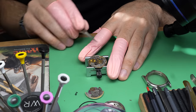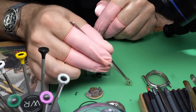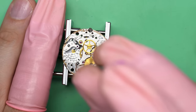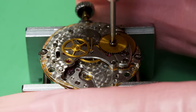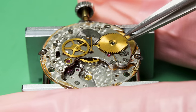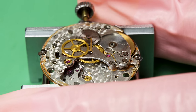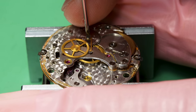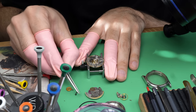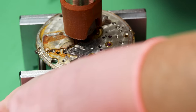Let's take off the balance and see how it looks, because that balance spring is so tiny — if it gets rusted, it's just done. Oh, that actually looks very good. The balance looks like it didn't get any seawater on it. Now we can take off the ratchet wheel, which also looks like it dodged the seawater. This whole upper part of the movement doesn't look like it was affected. It looks like the water came in through the crown and went to the keyless works, which makes sense, but also made its way into the middle of the watch.